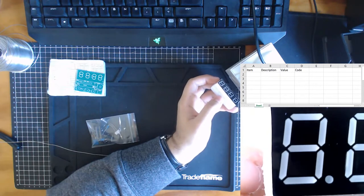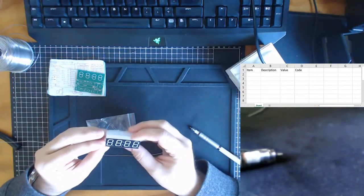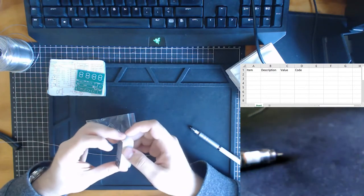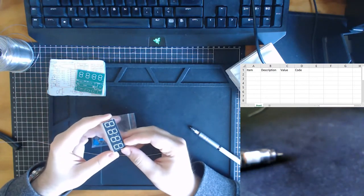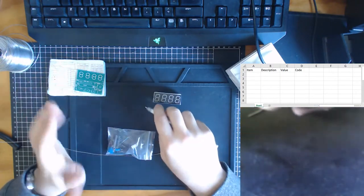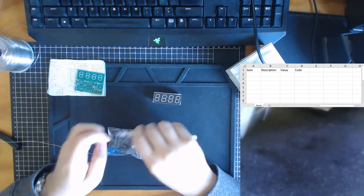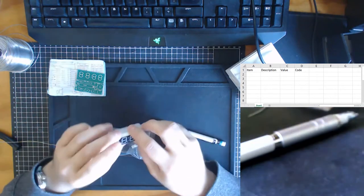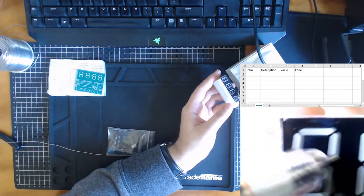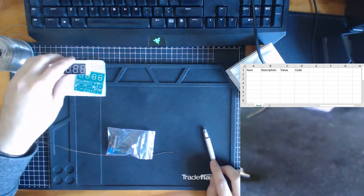This would be one of the more common elements that you'll see in real life, like anytime you see a number ticker that isn't on an LED screen. Old calculators would use seven-segment displays. If you're using soldering irons that have adjustable thermometers on them, they will have seven-segment displays. Microwaves, a lot of commercial products use this because it's incredibly cheap, because each one of these segments is just a single LED. So it's actually a very, very cheap and effective display.